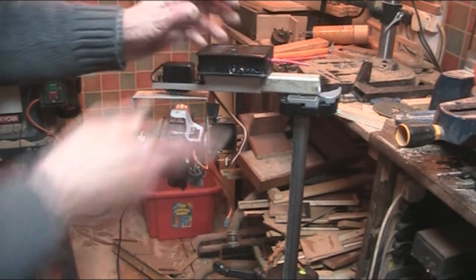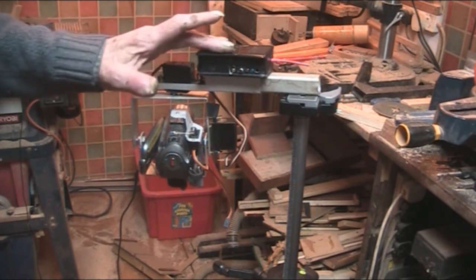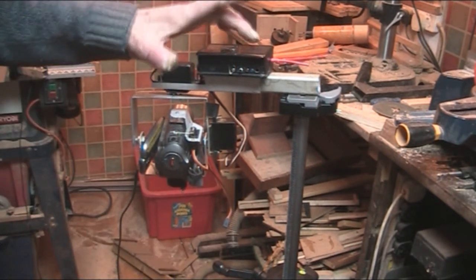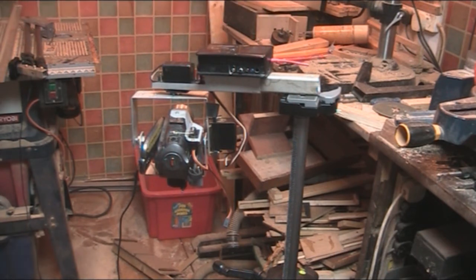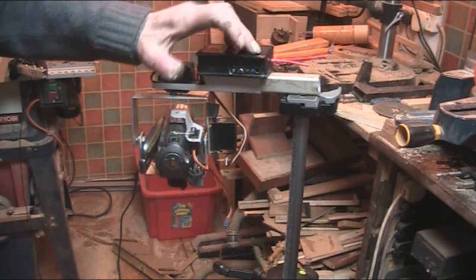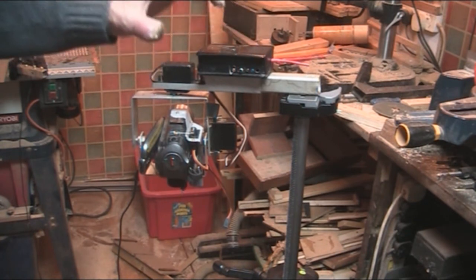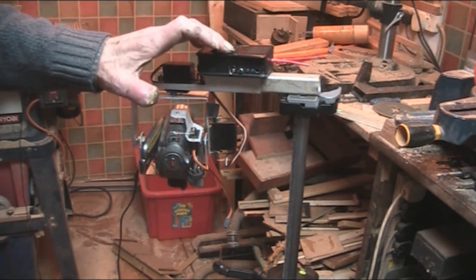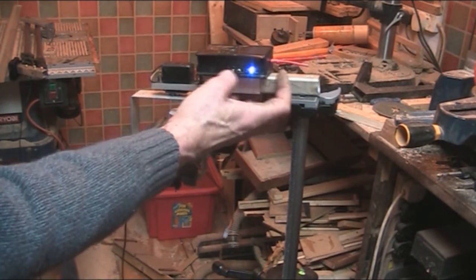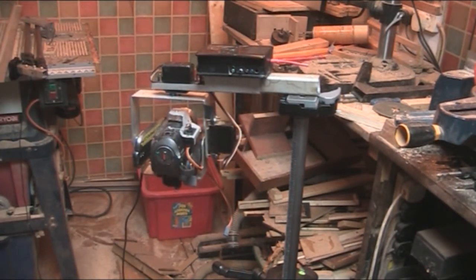The box on top was originally smaller and the radio control module sat on the outside. I've now put it into a different box - this is an old power brick that was no longer useful. There's a small LiPo - not an 18650, it's the shorter one, probably a 184-something - along with a USB charger and a boost converter to take the LiPo voltage up to 6 volts for the radio control. The radio control module itself is inside along with an on/off switch, which has a blue light on the outside because I can't see the LED on the control boards.